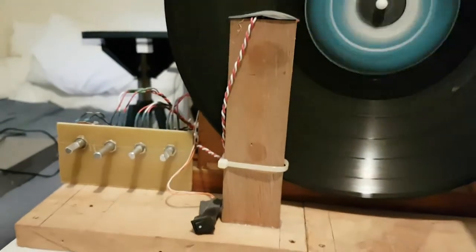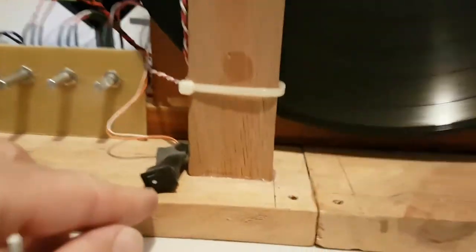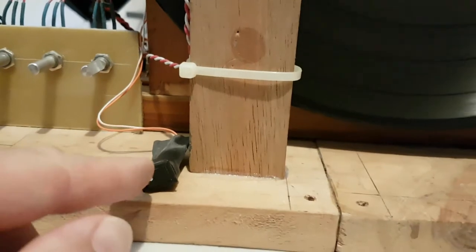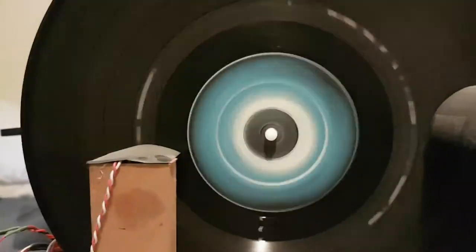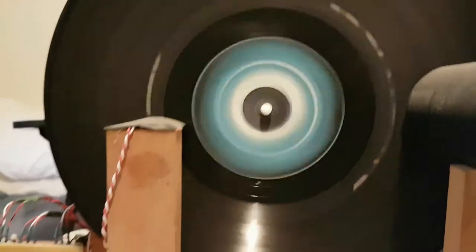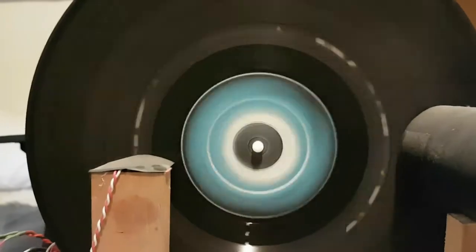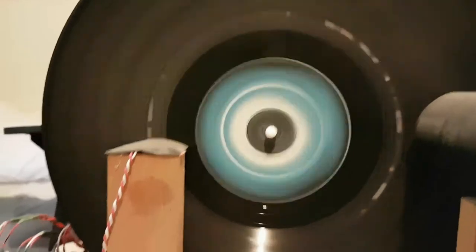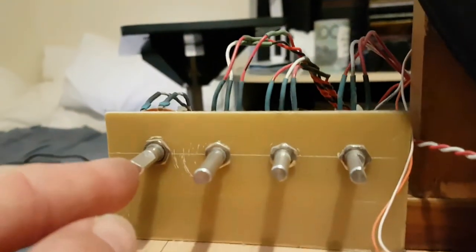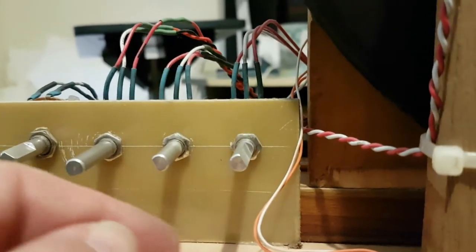Switches, and I can't exactly remember what's what, but I worked out this to be a speed booster for the Nipkow disc, because when I start it all up, it goes at too low a speed, so I need to pump a bit of voltage into the motor to get it functioning a lot faster. I think this is the signal strength, this is brightness, contrast, and that's a synchronization adjustment.